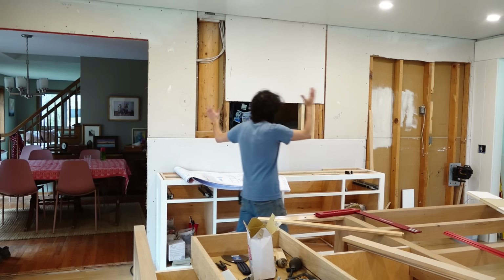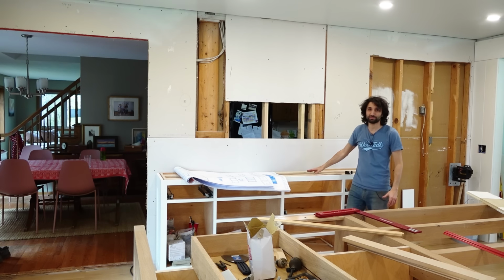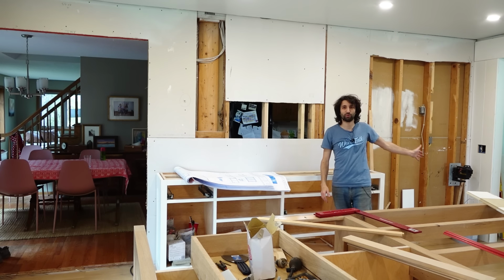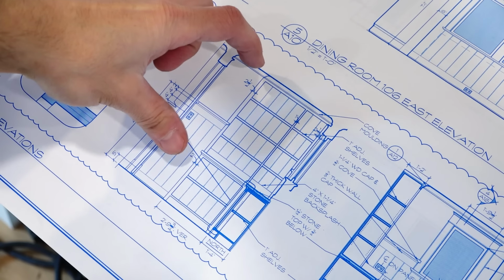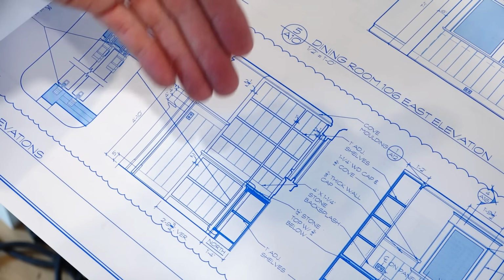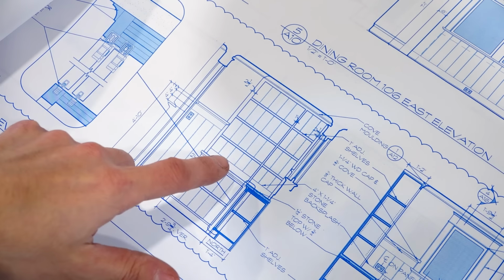We have a dishes cabinet that's going to sit right here on top of this buffet. And then we have a smaller one that goes in the pantry over there. So we're going to take a look at the pantry one first because it's the easiest and it's also mostly done. So it's going to sit in there on top of the lower unit, which is already installed in there. We have already cut the plywood box pieces. That was back on Donovan's CNC. So I've had those ready to go for a while. They need to be painted and they need the bus bars for the undershelf lighting installed. And then we need to make this face frame to go in here.